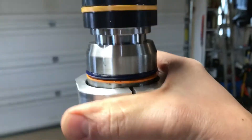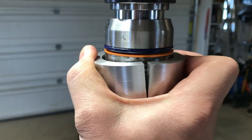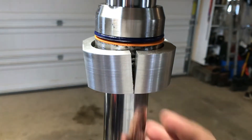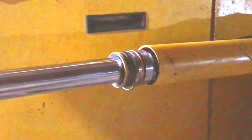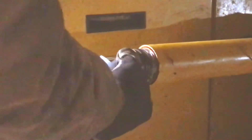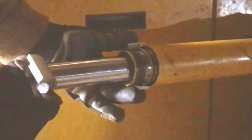The tool fits over it like that, and then I put a clamp on the flat spots to clamp it together. I can then use that to press it into the cylinder — it keeps all the seals and that snap ring tight so everything slides in. Otherwise it's nearly impossible to get done. I already installed the piston using this tool to protect the seals on the way in. Now I have to do the end cap with the snap ring, getting it in position without pinching any of the rings.